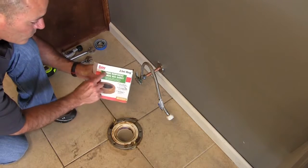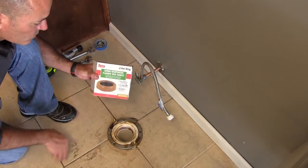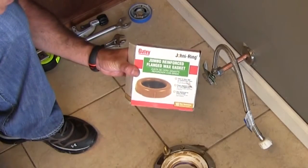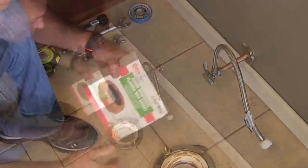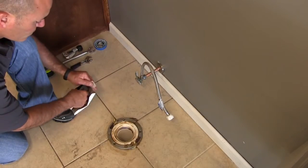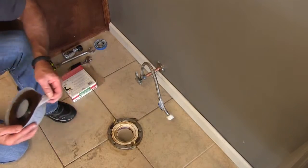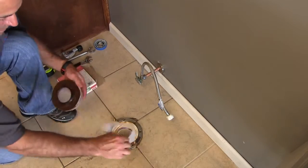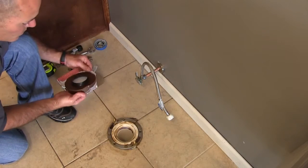What I've got is a metal ring flange and a wax ring, which we have to have for a toilet. The wax ring seals the bowl to the flange so that on each flush, the waste is not going all over my floor or all over the ceiling below.